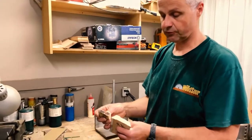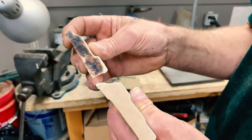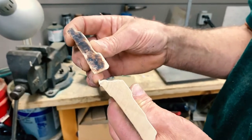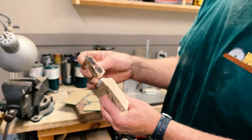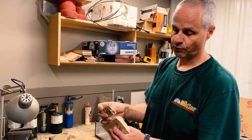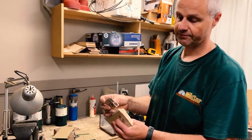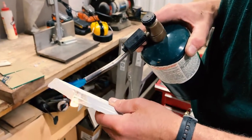A customer brought in these old pieces of trim and you can see a lot of gummed up paint on them. You don't see the profile as well as you probably should, because these trims are probably in the neighborhood of 80 years old and maybe have four or five coats of paint on them. So we're going to prepare them, make templates that match the profile, and then grind a knife. We're just going to heat the corners up a bit to get the paint blistering.